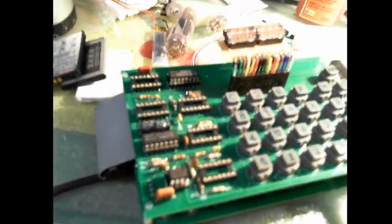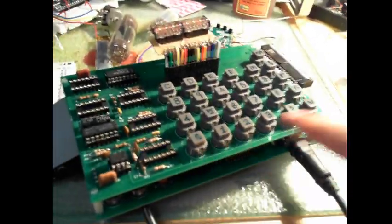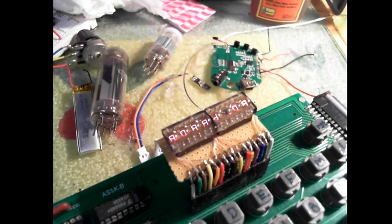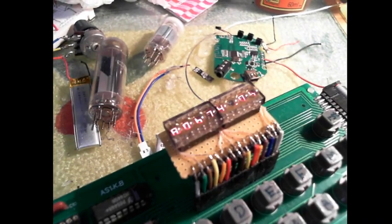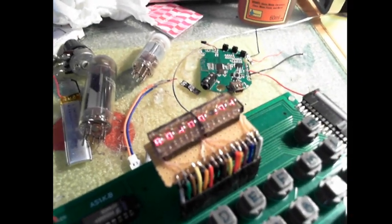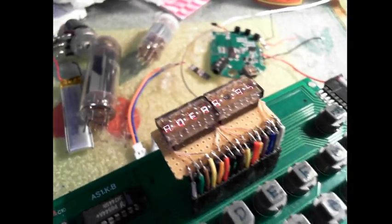So yeah, none of this is original, although I did use 1970s parts where I could find them in my part stock, but I still have to populate the tape drive chips. That just went on the back burner because I sort of finished this around the time I actually moved. If you go under there, it actually does have like 1980s parts. I've tried to use as many vintage parts as possible. And all these little tactile switches, Jesus, these are expensive, but hey. Also difficult to find actually, and they took a long time to come in the post, but I think they came from China. And then the display I made using original bubble LEDs, because bubble LEDs can't be beat. I basically wired it up. I literally reverse engineered the pinout of the original display used by this and created my own display module. Because, yeah, I could have bought one from the guy who made the kit, but that's just not going to look as cool. It's not going to have that 70s feel that the Acorn System 1 did.